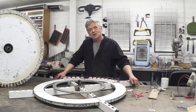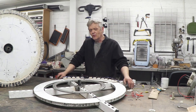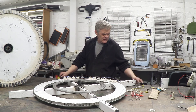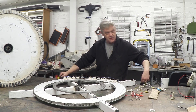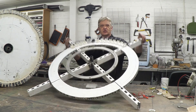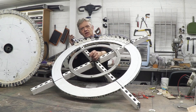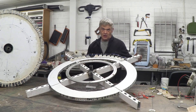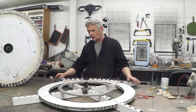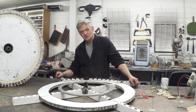In the last few weeks I've spent my time learning to weld — one reason was building a bike, but the other was the worry about stability of this. So what I've done is take some really chunky bits of metal and weld them in a crisscross pattern. This steel is three-millimeter-thick industrial shelving I found in a skip, chopped up into an X section, with a central pipe welded in. That pipe is now very much more stable with long legs to help stabilize it, and of course that helps stabilize the rotor as it turns. This hasn't actually cost anything extra as I used scrap and my newly acquired welding skill — I used two welding rods at about 10 pence each, so I suppose it cost me 20 pence.